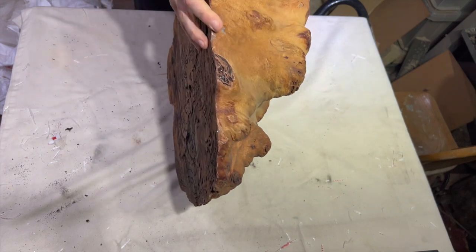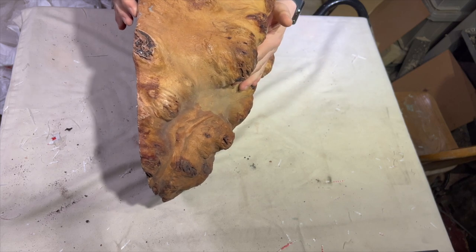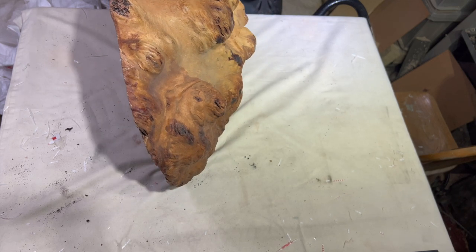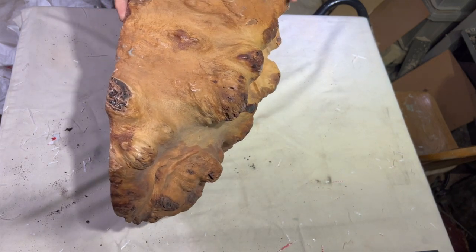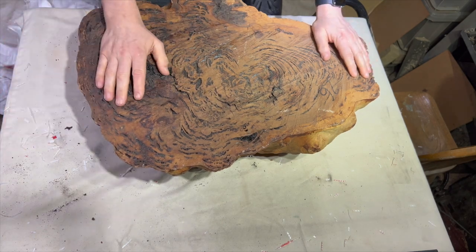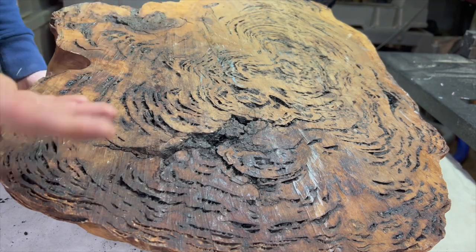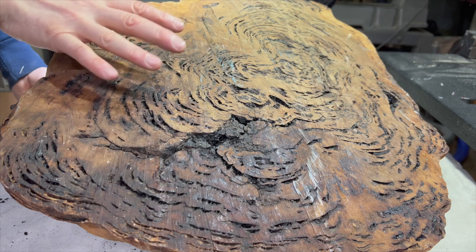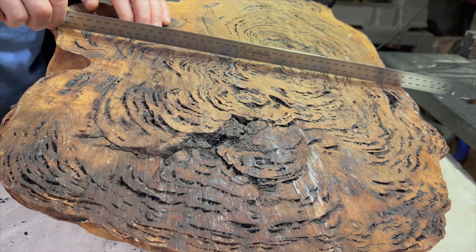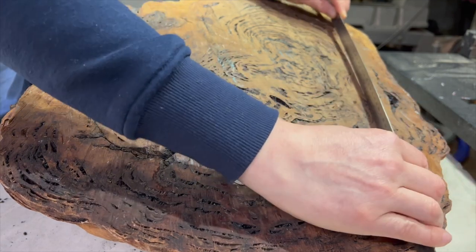I'm going to need to trim that down about halfway. I want to try and save a smaller version off the back, and cut this maybe three inches deep, and try and save some of that. Because at the moment with that depth, that'll be wasting an awful lot of wood. It's not perfectly flat - it's cut off the tree, it's got to dry, it's going to warp, and the cuts aren't always going to be perfect. I've got quite a high area here, quite a ridge all the way across the middle.